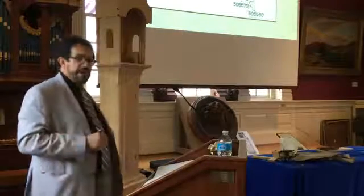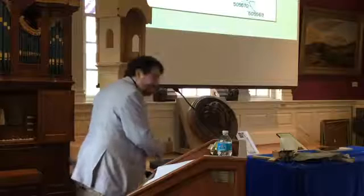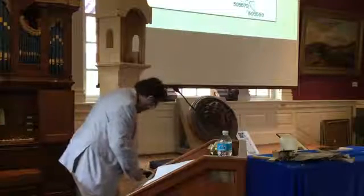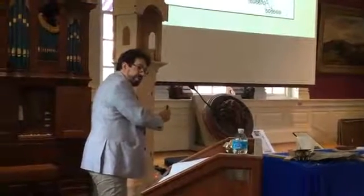So traditionally, there's no nails on a clock case, only from the back. The back is nailed into the three pieces. So essentially, the clock is made up of boxes, in my mind. When we're building clocks, we have the base. You build the base box. You have a frame at the bottom, and you have sides. You build the midsection. You literally take the midsection and you slide it into the base with about 4 or 5 inches to go, and this beautiful crown molding holds it. It holds it vertically, holds it sideways.